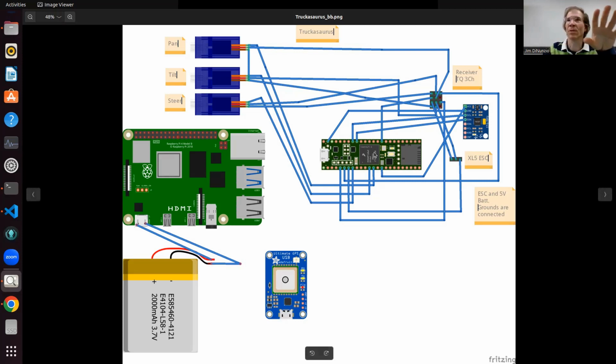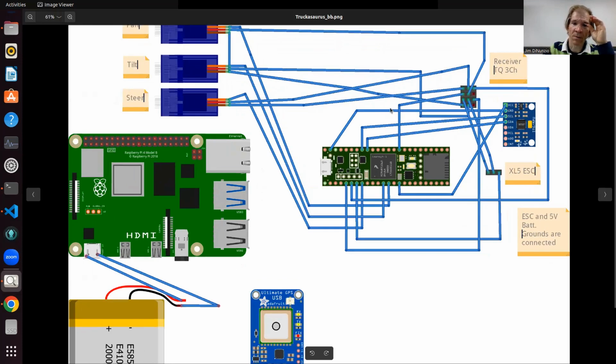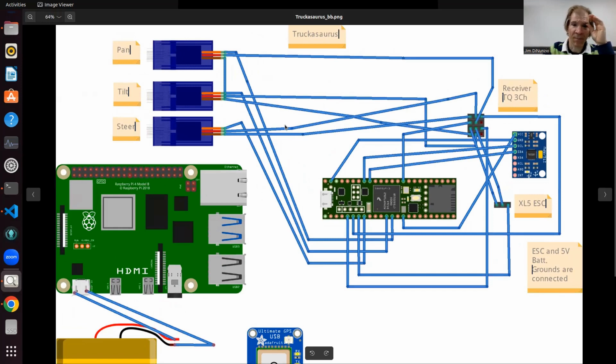This is an intro course, so I'm not going to talk much about micro ROS. But micro ROS uses the code that's available in the Lino robot code base, uses the IMU and has support code and drivers for it. So you hook it up and it publishes an IMU topic in ROS, and that helps the whole system know where it is.